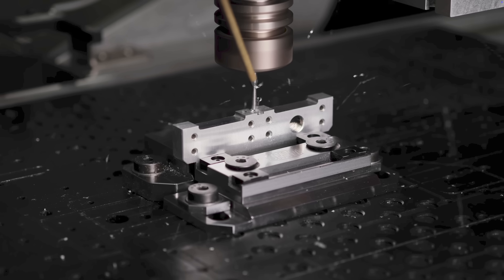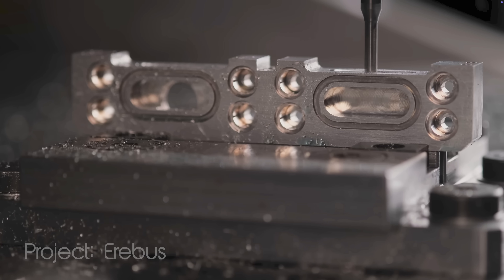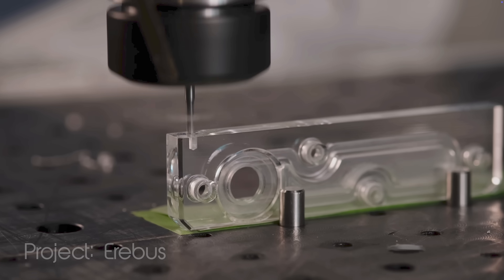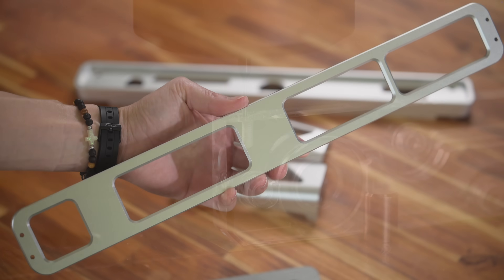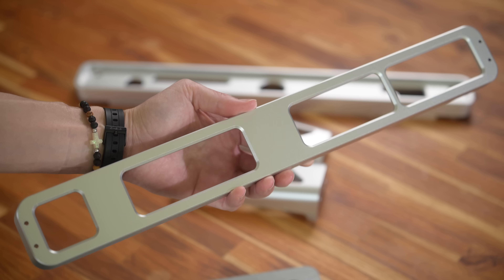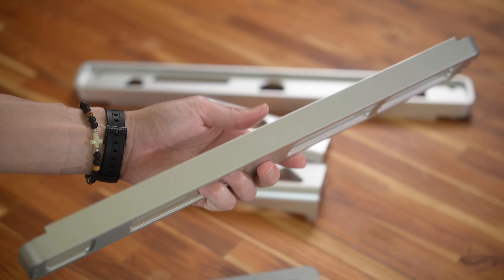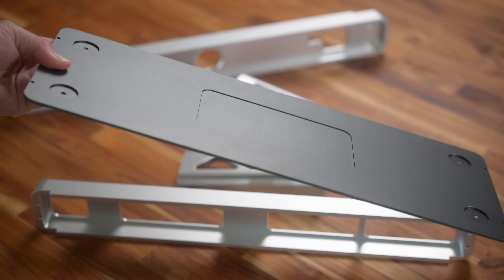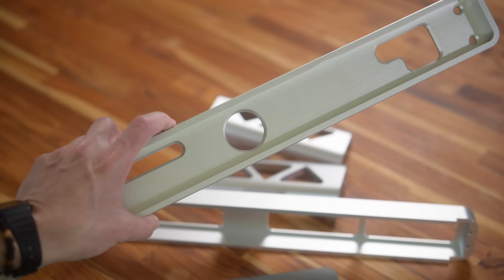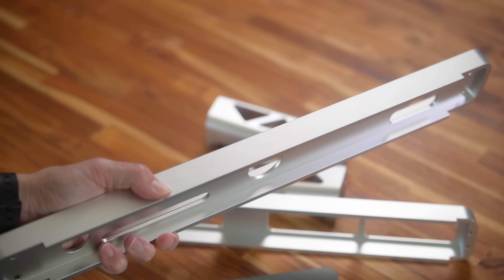I can find machinists to do the work I need, and we're even pretty decent machinists ourselves, especially Eric and Drew. But anodizing is very complicated — to get multiple pieces the exact same shade, you actually have to have the same density, the same mass, the same surface area, and put them in the same area of a tank, just to hope that the shade lines up and doesn't mismatch. Then an idea popped in my head: PCBWay.